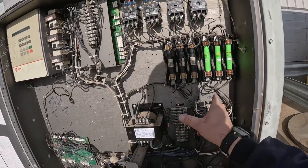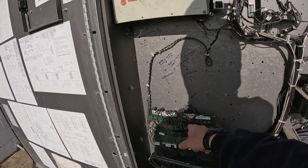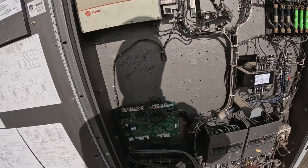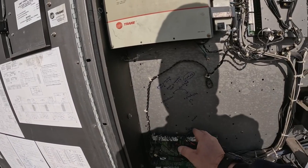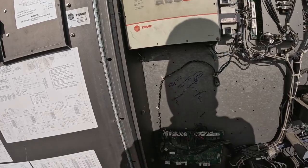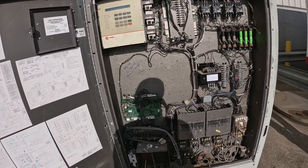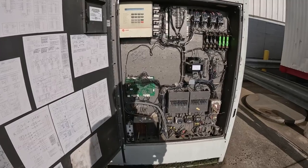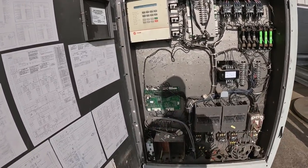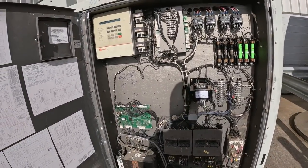When I originally got here, I checked all my circuits there and it was fine. The problem we had down here was the outputs on one relay — because it tripped out so quickly, partially because I didn't have the proving switch on the contactor closing, but also we have a bad relay — the relay that always controls the first contactor that wanted to come on was not sending power out on that one. Best just to measure across it — sure enough, it had 120 volts there with an open contact. That was the problem there. It's running — it's a turd, it needs replaced very badly. Hopefully they'll choose to replace and not repair. I hope you enjoyed it — I surely didn't. But I am prepared next time I run into one of these what to look for. There's only one way to learn, and that is to dig in there and get at it, especially on something this old.